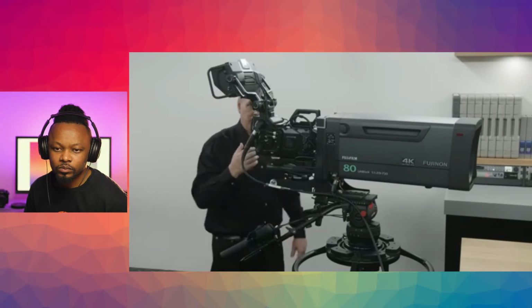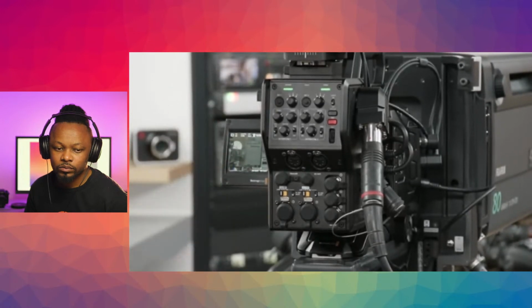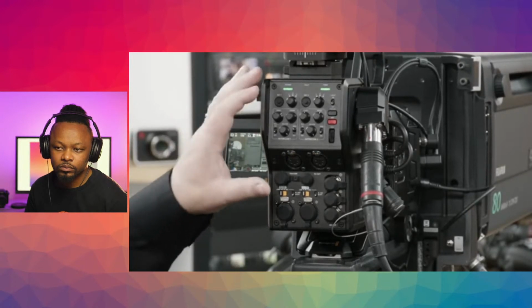And you can also see I've got a Blackmagic fiber converter on the back of the camera here. It converts the camera to SMPTE fiber, up to 2 kilometers away. It bolts on where the battery plate is. Now the SMPTE fiber link's actually a 10G Ethernet cable. So it has really nice studio camera features at the back of the camera as well. See if you can get a shot of that.